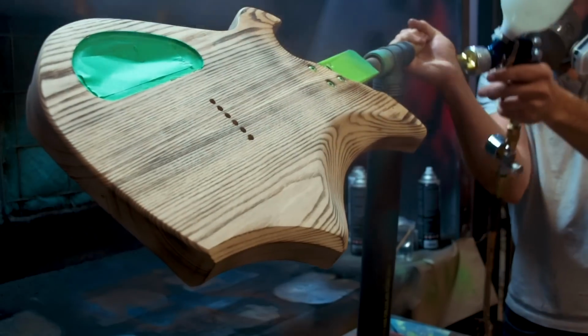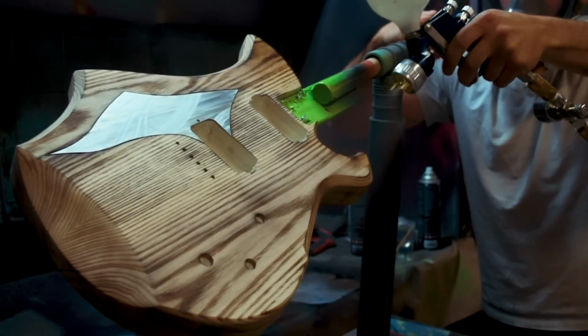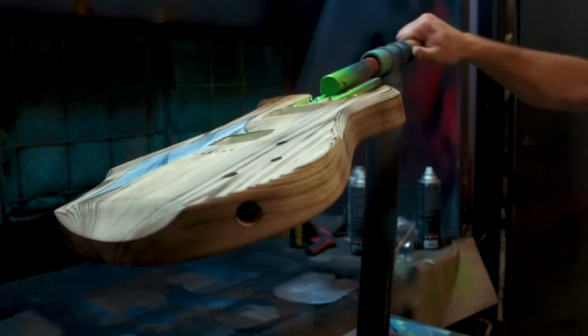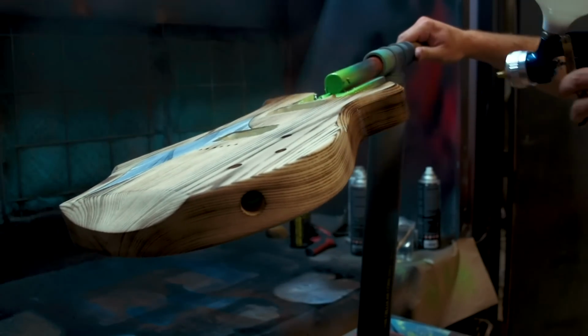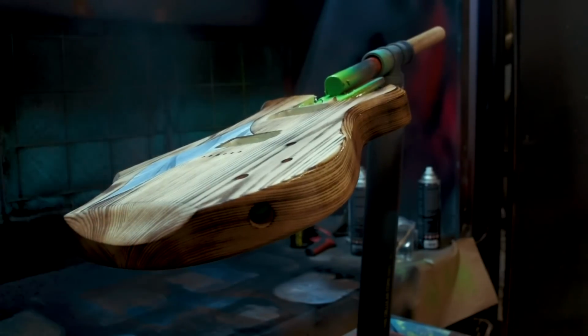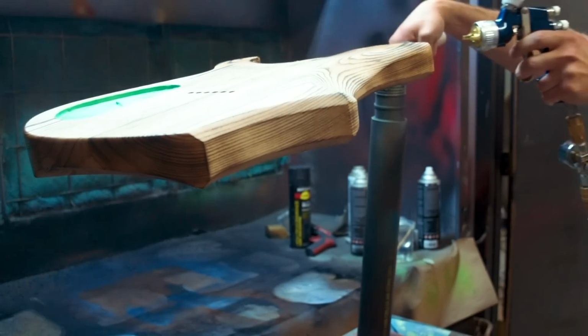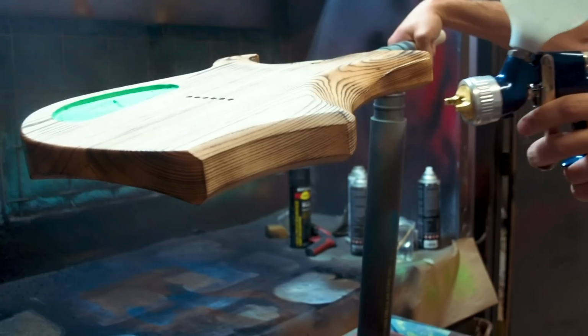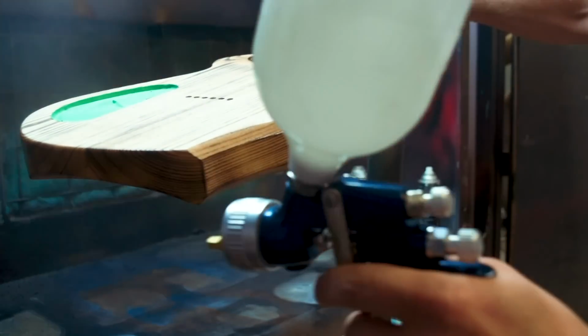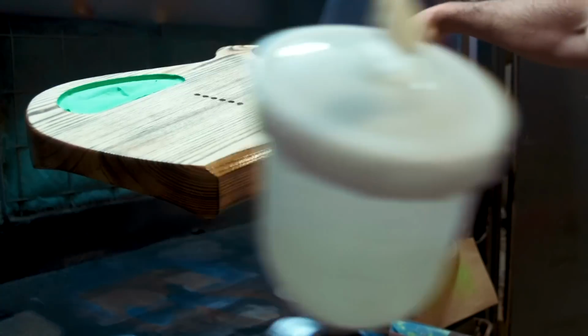An oil also does that, of course, and this is the type of finish that a lot of people would just go over this wood with True Oil, or my favorite, the modified tung oil from Mohawk, or a Crimson Guitars finishing oil. They've got their system with the penetrating oil and then the finishing oil that works wonderfully. I've used it before as well. It's a good option. So a lot of people would come in with that, and that would work quite well.